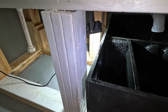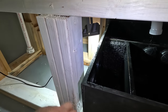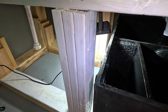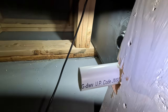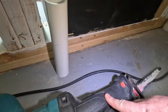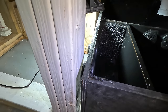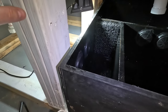This is five and a half inches — it's a two-by-six — and I need to take out about one and three quarters inches, a little under two. Across a triple beam it should still be fine. That didn't turn out too bad after all — only had to do an inch and a quarter there, so most of our triple beam is still intact. The hole saw wasn't going to cut it — had to bust out the Sawzall, and it ate right through there. Now we have a nice custom fit. I was going to say 'like I intended,' but obviously no one's going to believe that. Best case: second scenario is we have a good solution to fix it, and we're all good — no tank crumbling down on my head.